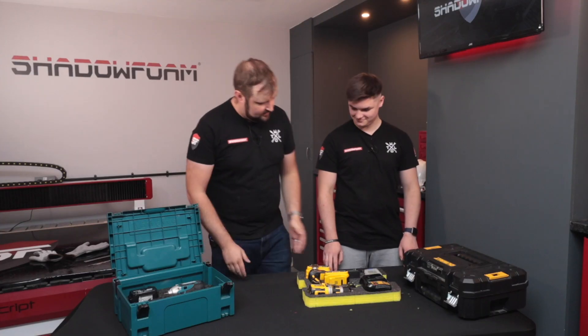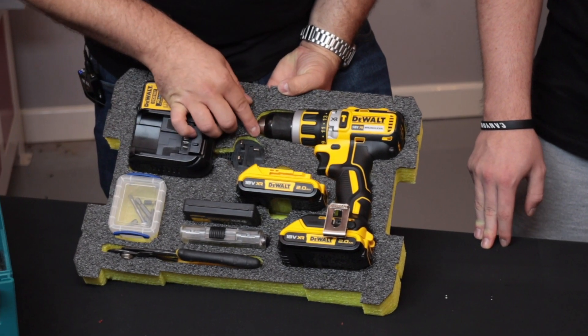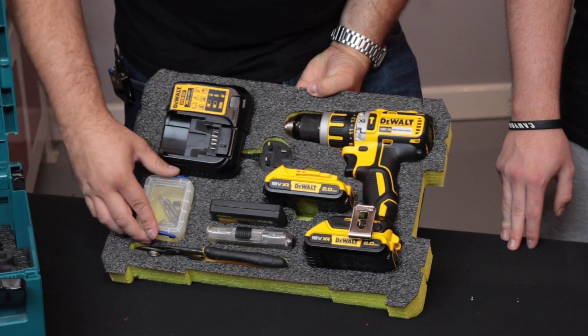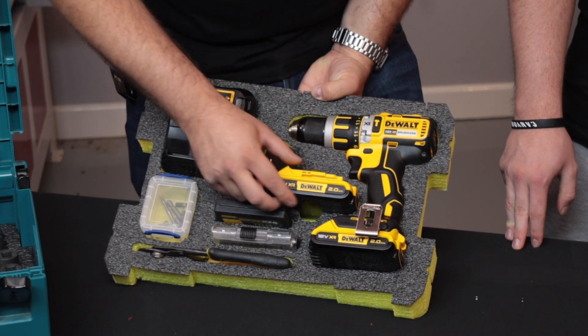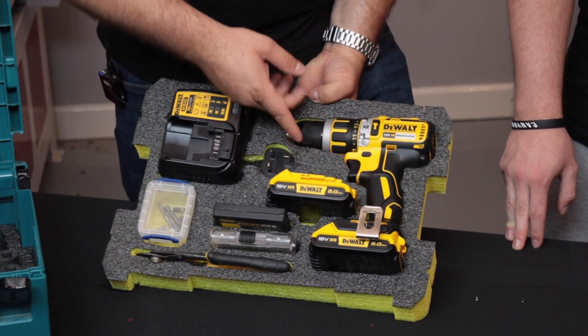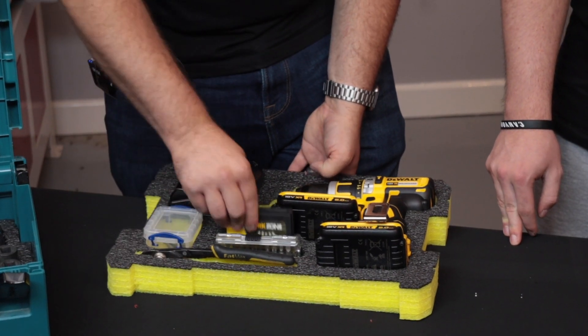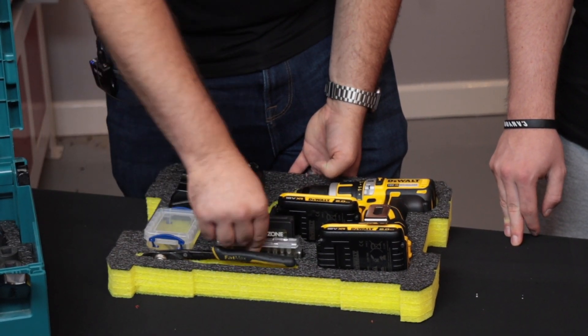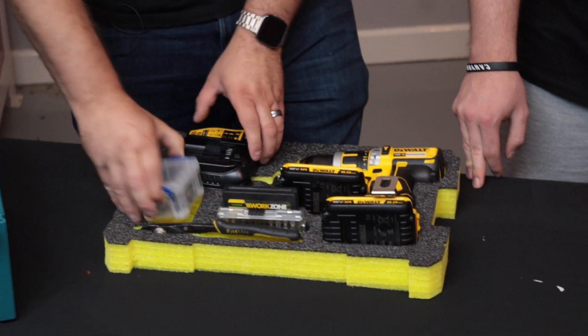So I'm really impressed with that, Dylan. You've managed to get everything at least 10mm apart, and you've really managed to squeeze all the items in there and still maintain a pretty good gap. You've gone down to about 8mm there, but that's still acceptable because it's only on one little point. When you've got items running alongside each other, you want to have 10mm. And you've managed to peel them all out there quite nicely. I think that's smashing, mate — you've done a great job of that.